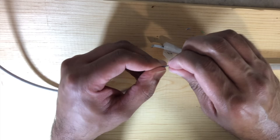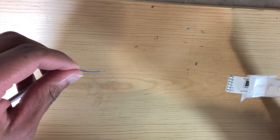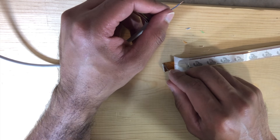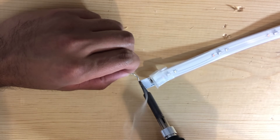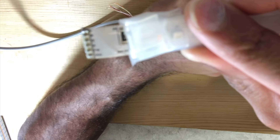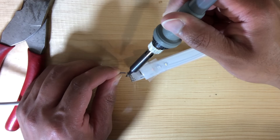The way I wired mine, I'm going to start with the blue. The way I found this soldering works best is by pre-tinning the wire and then pre-tinning the actual light strip. Pre-tinning means you put a little bit of solder on the wire and a little bit of solder on the light strip, and then solder them together. You can see that first terminal has a little bit of solder on it now. You'll want to repeat the steps for all terminals and then solder the wire onto the light strip.